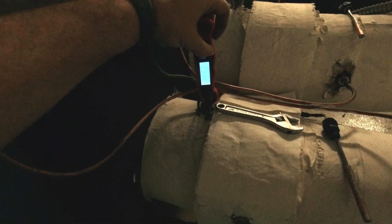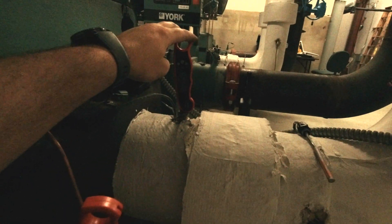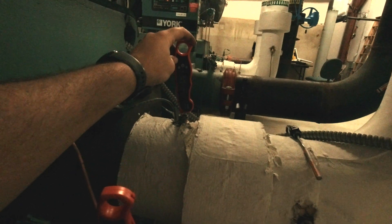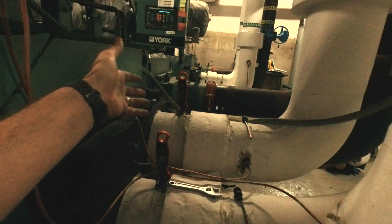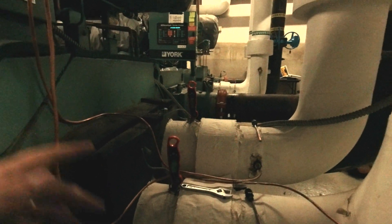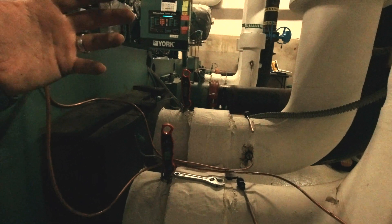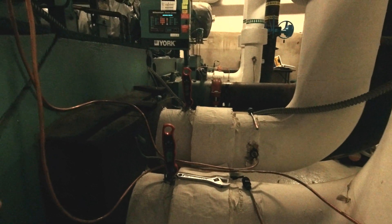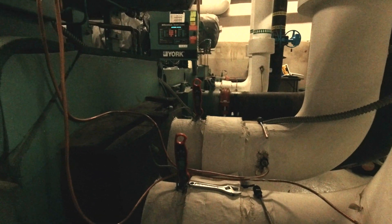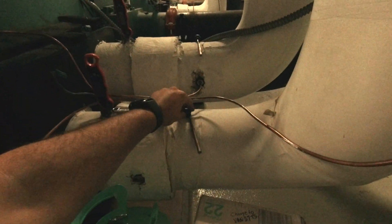Our entering is matching up — I'm happy with that — but our leaving, that's our problem right there. We were showing 42-43 where I actually got 50, which is what I expect. 50 makes sense since the chiller hasn't been running; due to friction of the flow through the pipes I expect that temp to go up. The fact that we were showing five degrees cooler on the leaving — that didn't compute. So that sensor right there is bad.